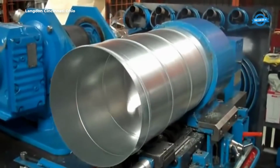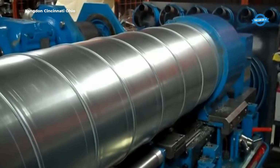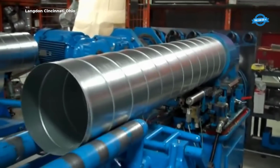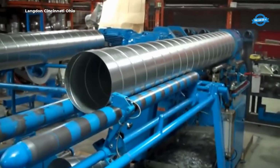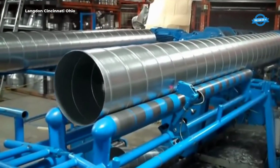Additionally, the machine requires minimal maintenance as no lubrication is necessary, thanks to the high-quality construction. All rotating tools are made of hardened steel, ensuring durability and long-lasting performance. The machine is ideal for producing high-quality, rigid seams while operating with minimal downtime due to its robust design.